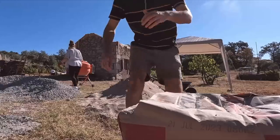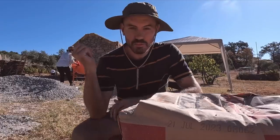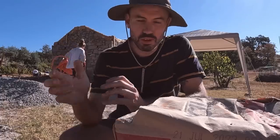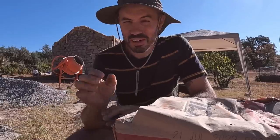Today has a real feeling of déjà vu. It was only a couple of weeks ago when we were getting the mixer set up, getting scaffolding set up indoors to try and pour this concrete ring beam. We were going to try and get it all done in one day but we were far too optimistic. We only got a quarter of it done, but that is not going to be the case this week. We are getting it finished by hook or by crook, although it's definitely a bit trickier this time because we're going to be tackling the gables and pouring concrete on a just under 30-degree slope — what could possibly go wrong.